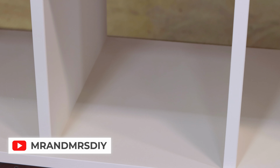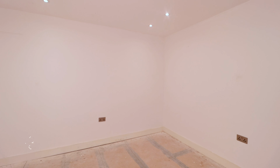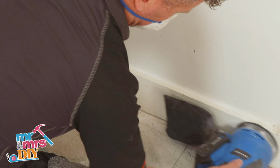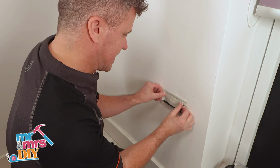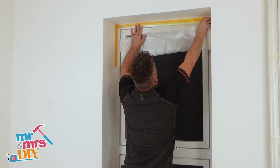In this video, I'm going to show you how to prep, mask and spray paint your walls. Start by sanding all the areas down first. Then mask up the radiators and any electrical sockets that you don't want any paint going on. Then of course your windows and window frames.